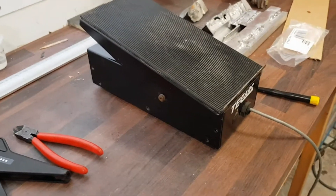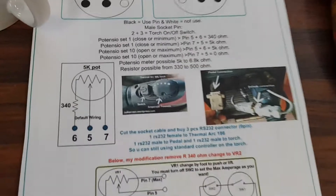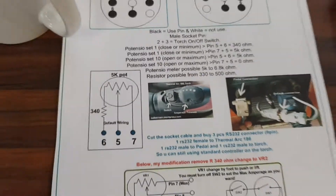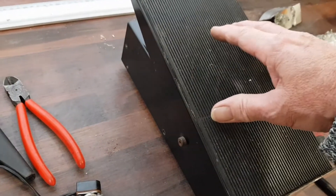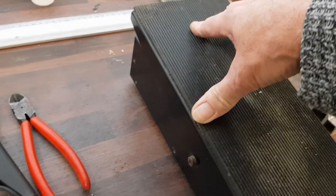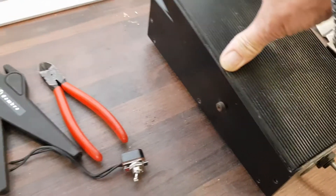Back to what I'm doing — this pedal. I'm going to pause the video and open the pedal up so you can see what I'm doing inside. Because apparently, to make it work, there's a modification some guy has put on — it's very good. He's modified one to fit. Basically, I have to put this switch on the side here and wire it in series with the switch that's in there. So when I press the pedal and switch that off, the machine won't start. And apparently then you get your current showing on the meter, and you can set it up to full depression and then adjust it on the front of the welder. That's what I've been told.